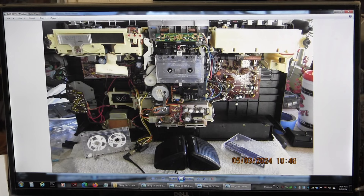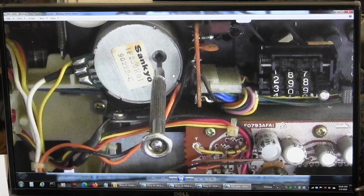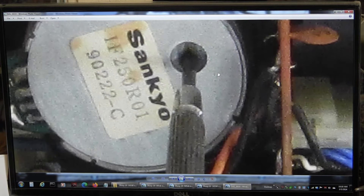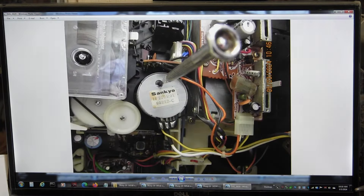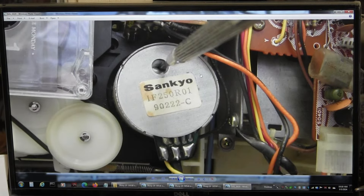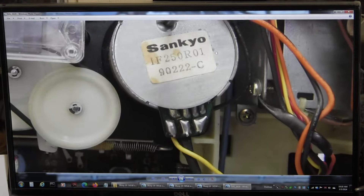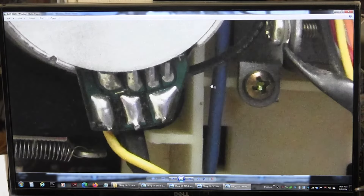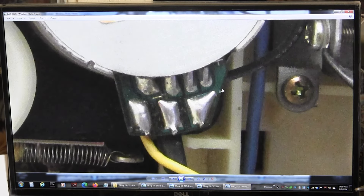Here I'm playing a cassette and testing it out. I have my two millimeter flat tip into the motor — that's the motor that's in this model that we've been listening to all this time playing my test tape. Here's another picture of it. If you're trying to find a motor that works, this is what works — it's a two-wire motor with this kind of connections on the back side. I should have taken a picture of that.